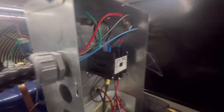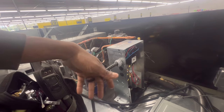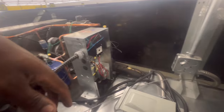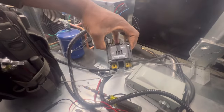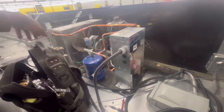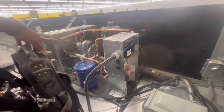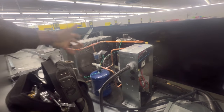Alright guys, so we got the new contactor. We're going to see if she comes on - she should. Temperature should drop. Now if I came and the unit was short cycling, then I would place my gauges on the unit just to verify the pressures. Maybe we had like a small leak somewhere - a common leak is on these fittings sometimes, or factory issues. Overall, real easy setup. Alright y'all, there we go - you can see it. Only two of us. Like I said, I changed one before.